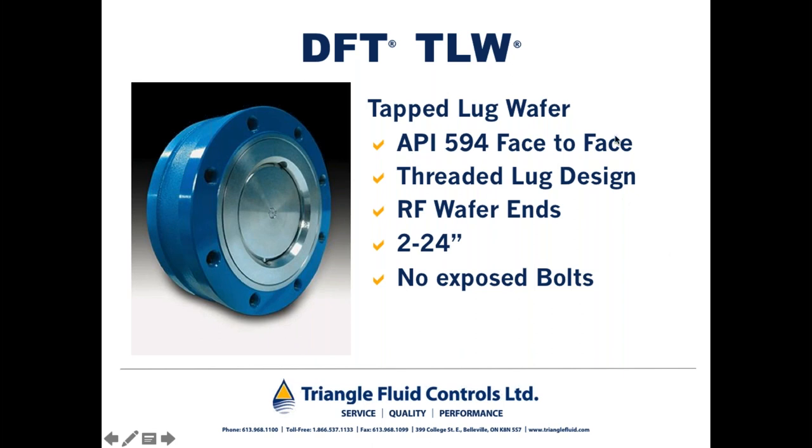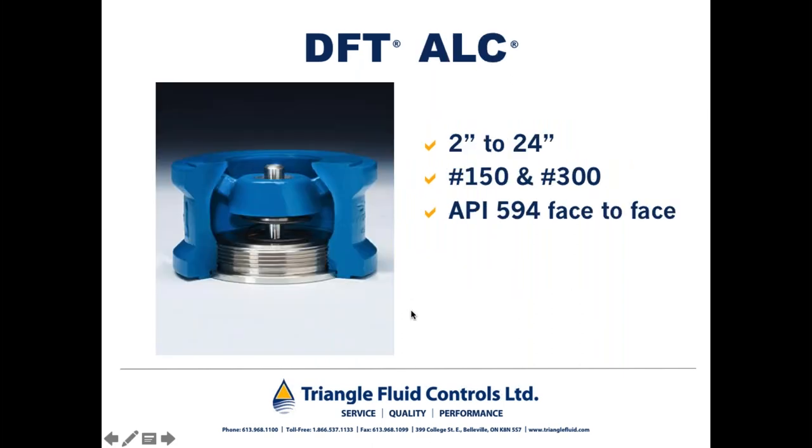API 594 face-to-face throughout its entire range. It is a single guided disc, so as I mentioned before, I would only recommend the use of this valve if you can achieve the 5 to 10 pipe diameters downstream from the discharge of the pump. Raised face wafer ends, available 2 through 24 inch, and as I've already mentioned, there are no exposed bolts, but at the same time, we offer a wafer style valve in this model.